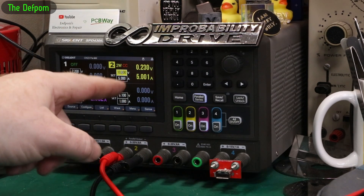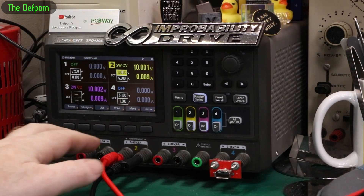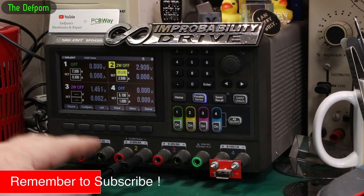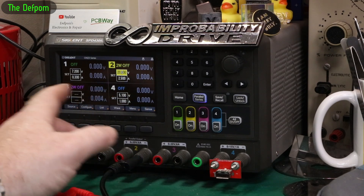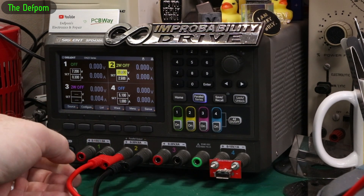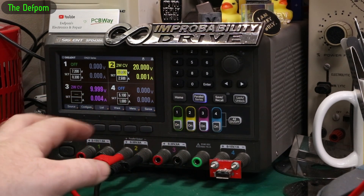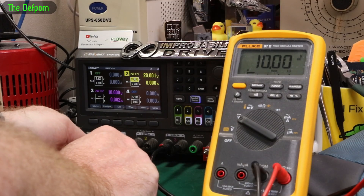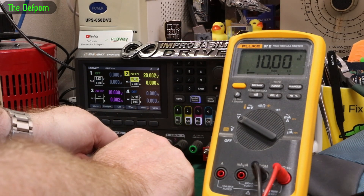That's brilliant — something I thought was quite important. Also, in my previous videos I didn't actually mention this, but in series mode you're effectively getting a split supply. If I hook up one channel here — that's doing 20 volts right now. If I turn that on, I'm measuring 10 volts at my electronic load on those terminals, and 10 volts on the other terminals too.